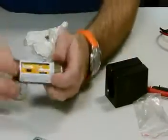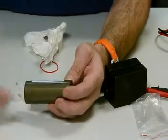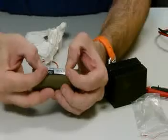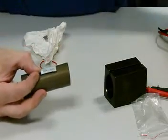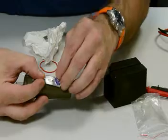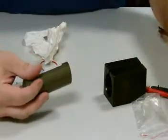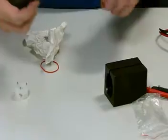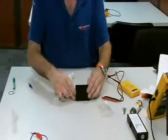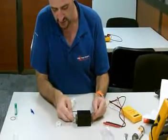On the Edition 1 PT9s, it's slightly different. You have an additional sticker which goes along the bottom of the PT9, and then taking the sticker again, you put it on here to show that the battery has been replaced at that date. Once you're happy with that, you then test the PT9, which is done with the shorting of the two terminals.